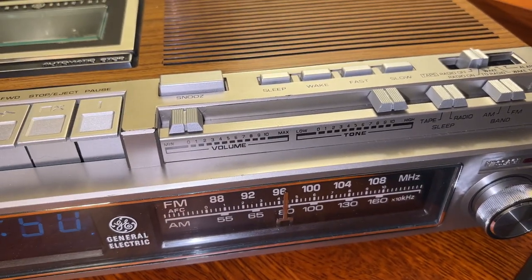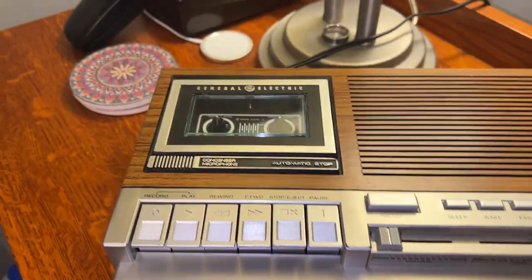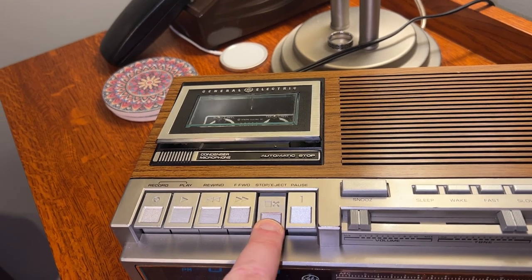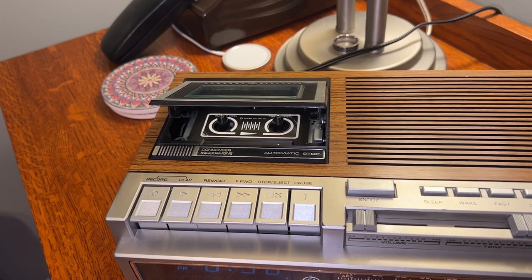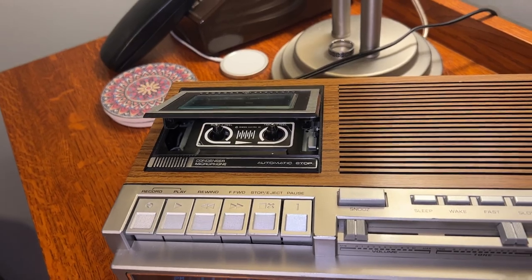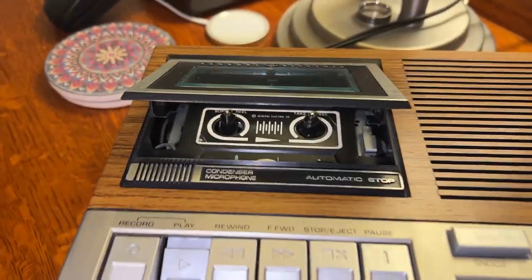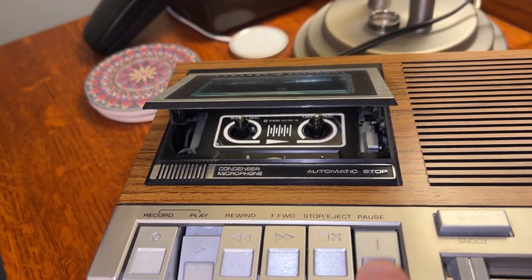This one gives you a tone control, lighted tuner dial. And this one does have a Tanashin mechanism, but it's the older version, the version before the cheap ones we have now. This one still has a rubber idler tire and damping. And I never had a problem with any of these ones here. These ones work very well. In fact, see, I got the radio on. I have to actually turn this off. There, now it starts up. So yeah, it's a very quiet mechanism, works very well.